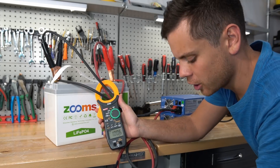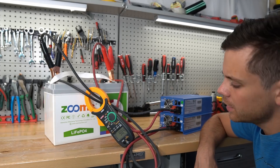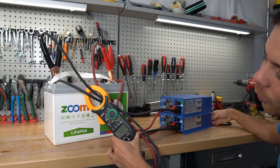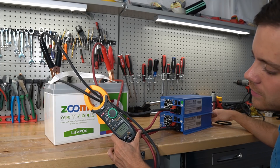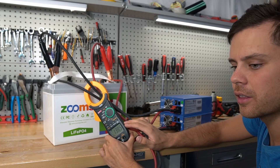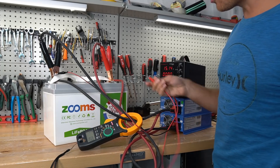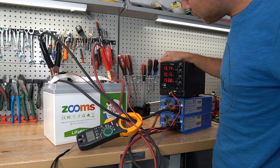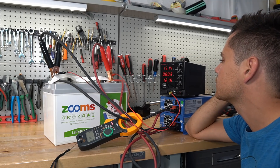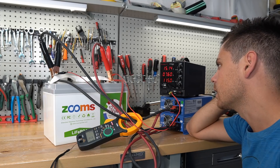If we trigger over-current protection, we know it can't handle 100 amps. It's been charging for about 10 minutes, so let's increase the current to 122 amps — 140 is the max I can do with these chargers. You don't want to do this with your lithium iron phosphate batteries; this is for testing purposes only. The chargers are done, but we're going to test the high voltage disconnect and get that final bit of absorption. Look at that — the current is dropping. That's just how these batteries work, but it's cool to see it occur.